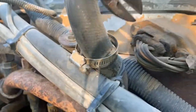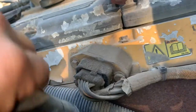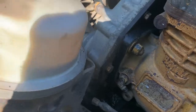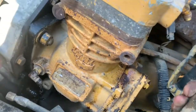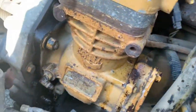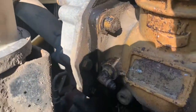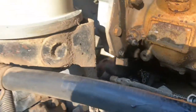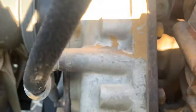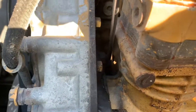I'm gonna take this breather out of my way because it's not too bad to do. Get this pipe out of my way — I'm gonna replace this hose here because it's hard as a rock. Just replace the bottom in here, and then I've got these bolts — three-quarter inch — one on the bottom there I'm gonna get with a socket wrench. There's the inside bolt back in there; get a wrench on that.